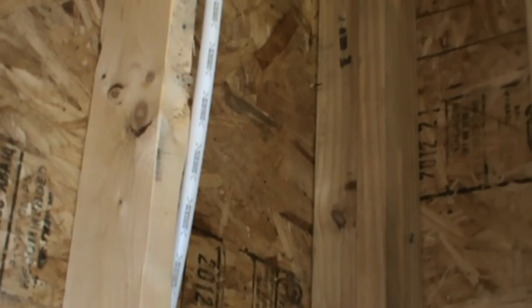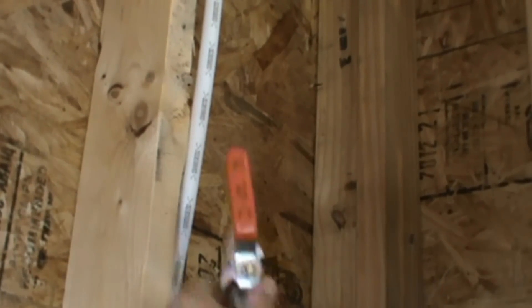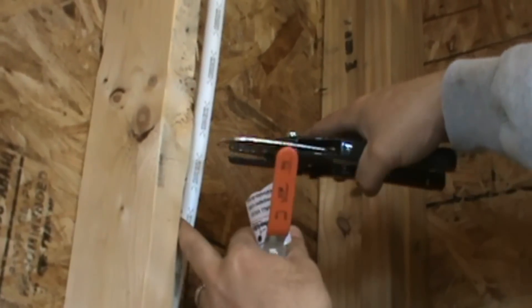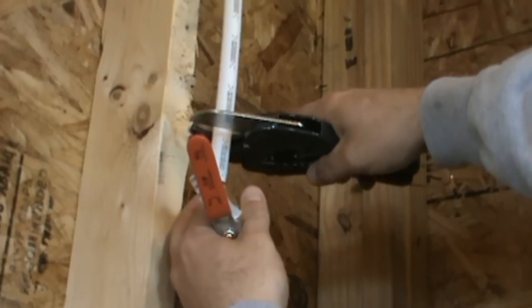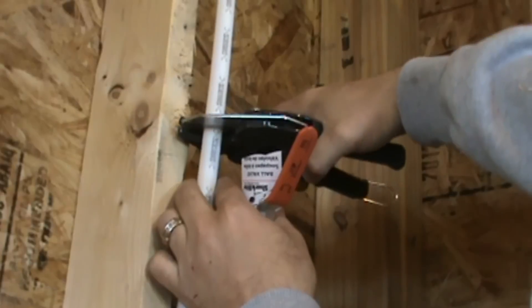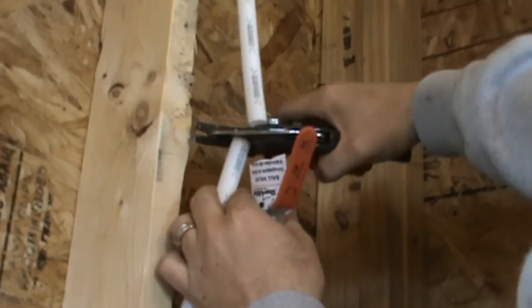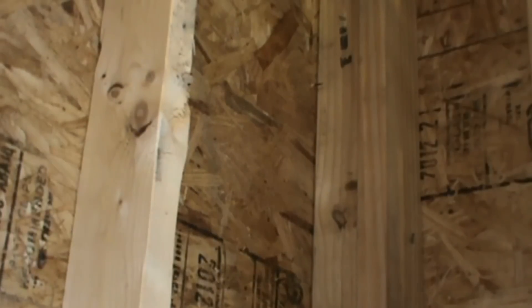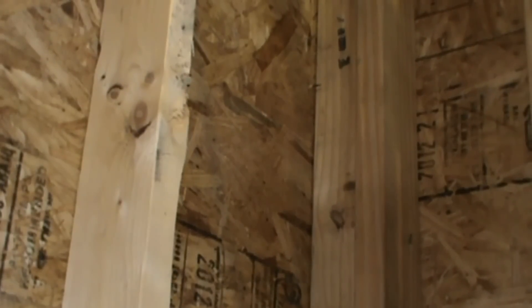What I'm going to do here is put in a shut-off. This is a PEX shut-off, and the reason for that is because I have a three-year-old running around that likes to turn on my spigots when I'm not looking. So from the inside of the shed I'm going to be able to control the faucet. I can turn it on or off from here and he won't be able to reach it because I have it about five feet up on the wall.